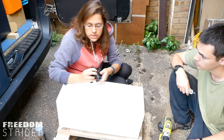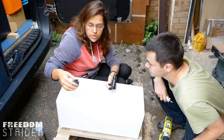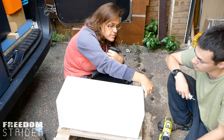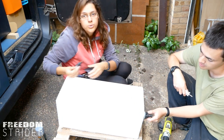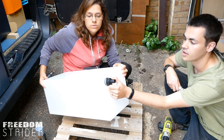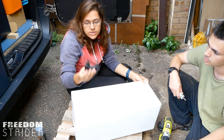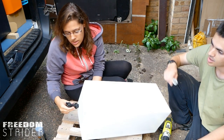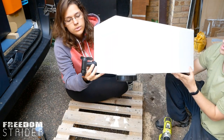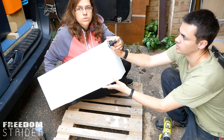Second thing, the inlet, the thing that comes from your sink wastewater pipe to the tank, comes at the top of the tank, on the side, something like this. And the tap goes diagonally. It doesn't have to be diagonal, but I would prefer to do it diagonally to the other side, at the bottom. So the tap goes in the bottom corner, and the inlet from the sink goes in the top corner.